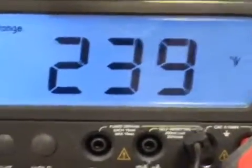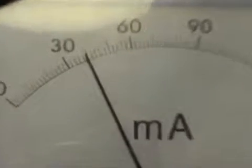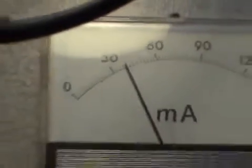I put the voltage up on purpose — got it up there, 240 on the table. I can put more on, but that's what it'll be running at in circuit anyway — about that or less than that. And there's me at 35 milliamp — it came up lovely and happy.